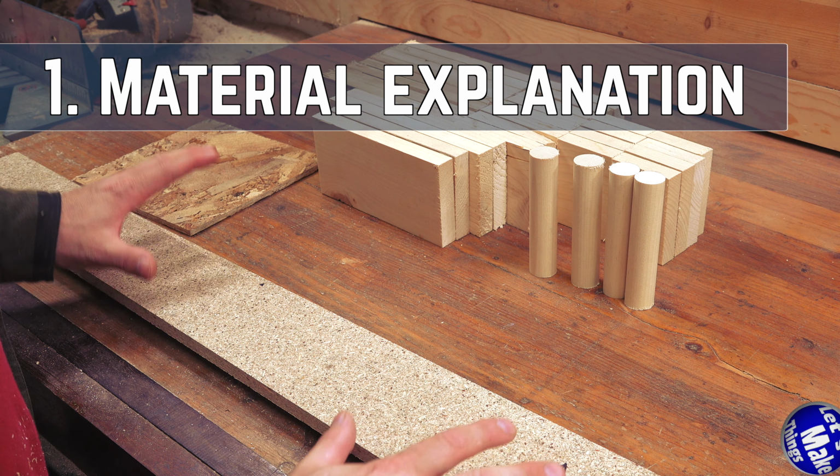Now, so this is easier for me to figure out where all the holes are later on, I'm just going to put a plus here and a plus there. That way I can figure out how this all goes back together. And I'll take the router off. I'm going to drill each one of these holes out with a bit that's a little bit bigger than the bolt that will fit in the router base.